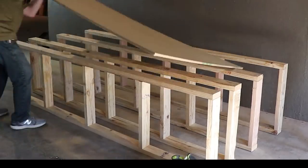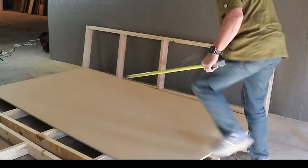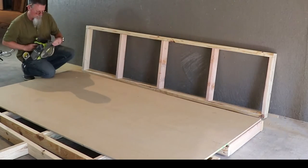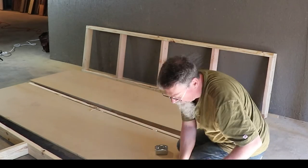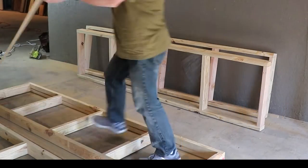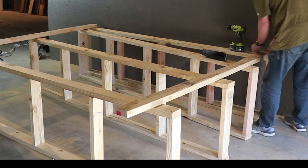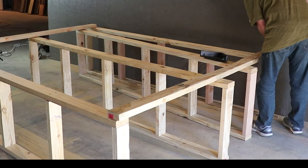Big fail coming up right here — it didn't work so well that time. But not to be daunted, I still had a sawhorse of sorts, even though I had to use my knees a little bit more. At this point we can start assembly of the vertical sections, so I started the top and the bottom and made sure it was fairly square before driving all the screws in.